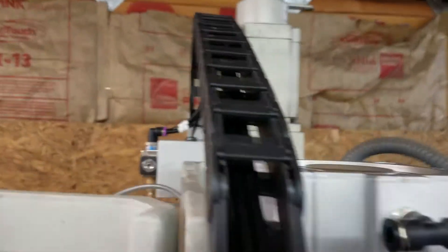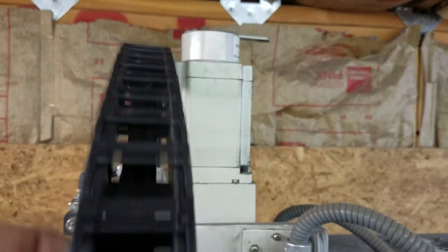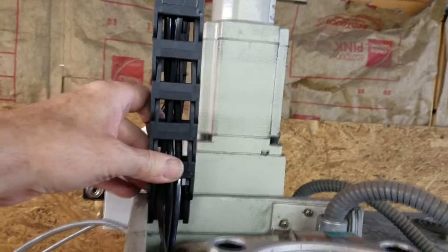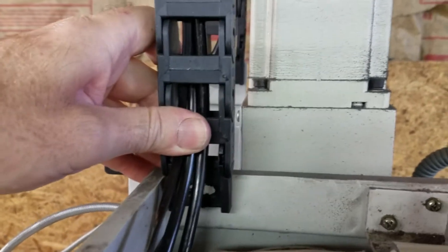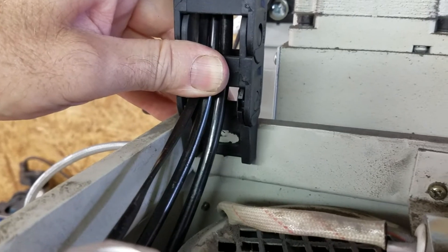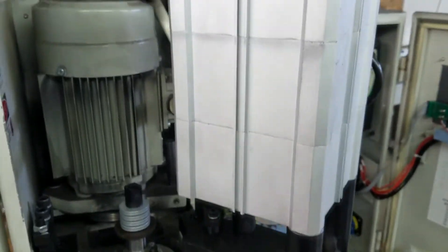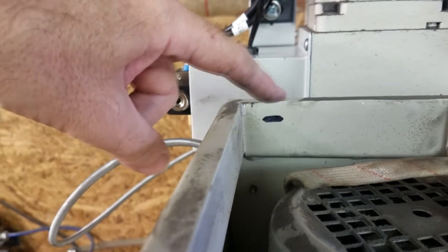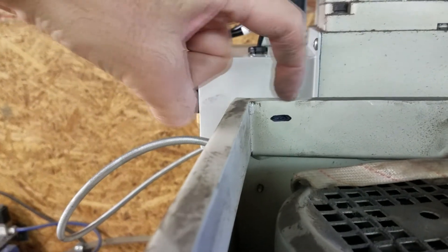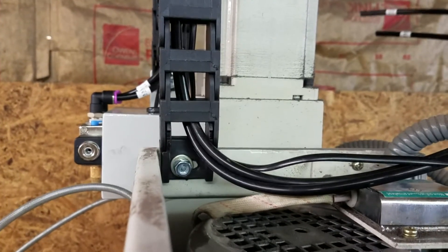For the next step, you're probably going to want to lower the head unless you have lots of clearance height in your shop, because it's time to mount this cylinder onto here. I'm supposed to put this over here, mark the hole, drill through it, and put a screw to mount it. It's a lot easier to drill if you swing the cylinder out of the way. I marked my hole about five-eighths of an inch down from the top so I'm not drilling into the cross piece. I got it screwed on there with the provided hardware.